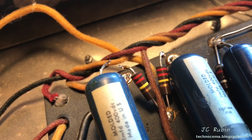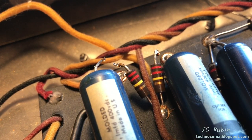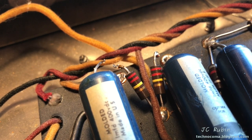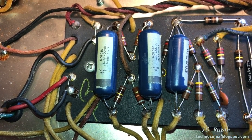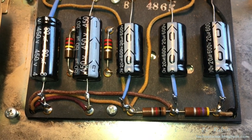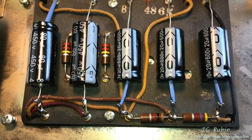I don't think there's anything less exciting than resistor swaps, so I generally don't record these on video. I just kind of come back and say everything's done. So yeah, this is me swapping out resistors. With these four replaced, I could finally flip the amp back over, take a look at the resistors on the top side. And this is another example of resistors I'm not going to run off and replace just yet until I see what the voltages are, because the line voltages have changed.